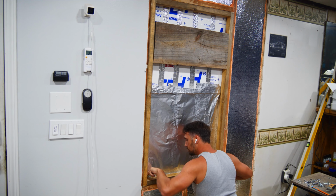The next thing that I'll be doing here is adding the electrical outlets for the TV, and I'll be doing that by piggybacking off of an existing outlet. In order to get to this outlet wiring, after removing the outlet extension and outlet cover, I'll be cutting a slot out of the drywall in order to have an area to access the existing wiring and run new wiring.